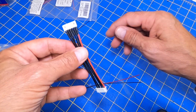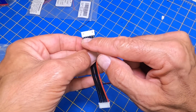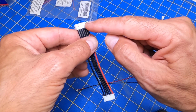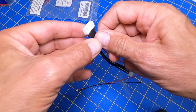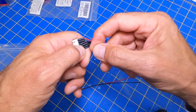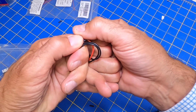Now, a couple things — you've got this little guy here. This is the end you're going to keep. This is for a five-cell battery; I don't have any five-cell batteries so I don't really care. If I had a 6S battery I need to use the proper plug for 6S, or 4S, or whatever you're using — you've got to use the proper plug. This is the only part you care about right here. Keep the red wire in, and if you just tug, you can pull these wires off. That's what you're going to do — pull all those off.